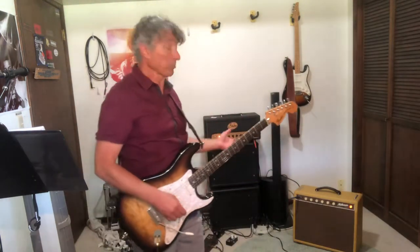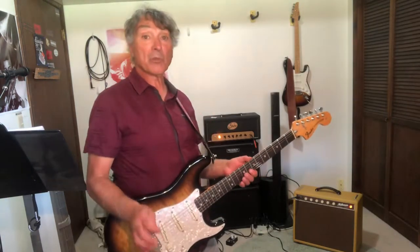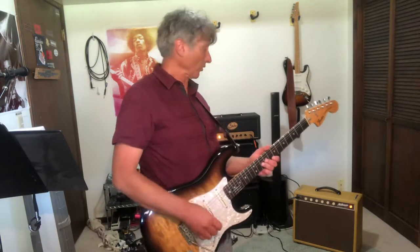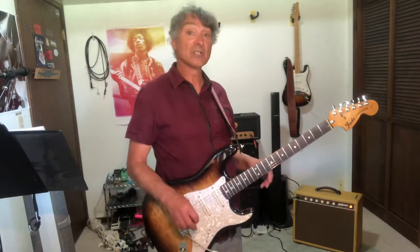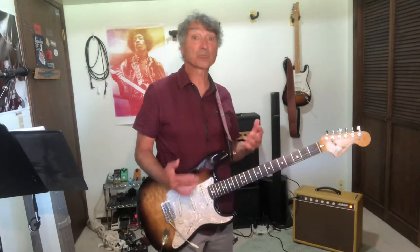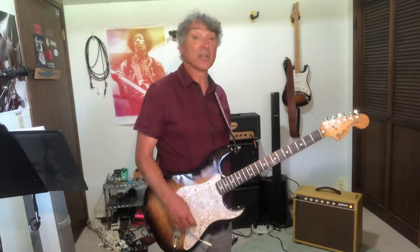So it's kind of a blackface Fender slash tweed. But for it to sound really good, the way I like amps to sound, it's a non-master volume amp. You have to crank it up to probably around 12, maybe about 2 o'clock is where it starts to sound good. 3 o'clock would be the ideal breakup, where the output tubes are being pushed and the speaker's being pushed so that it delivers that beautiful sound. And remember, amplifiers are meant to be played loud.